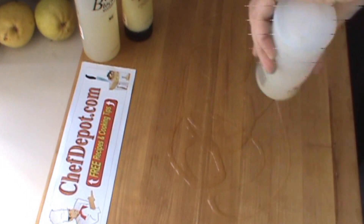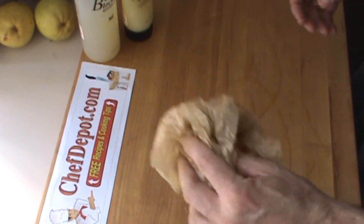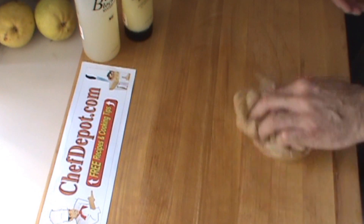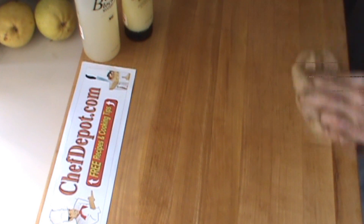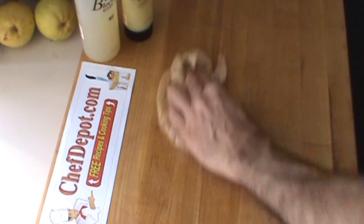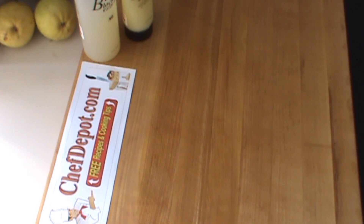I'm going to apply a little in a circular fashion all over the board. I like to use a scrunched-up bag — it's recyclable and it's safer. Wet, oily rags are not so safe because any oil can be flammable, so you just have to be careful. I really like this process — it works beautifully. This is really nice. It will penetrate and it will be dry by morning time.